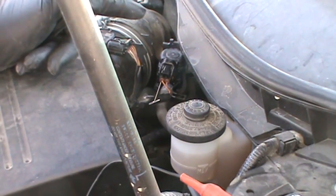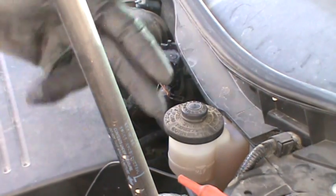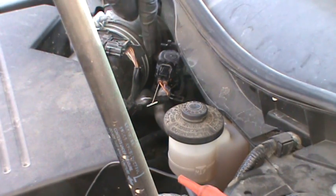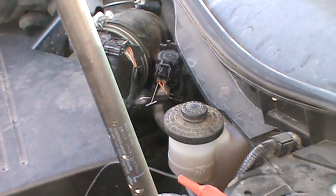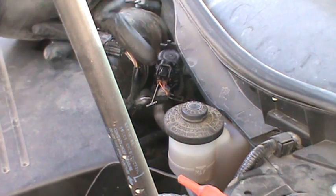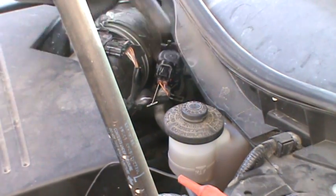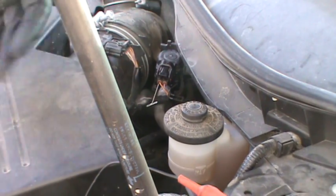The point is, when you got a wire going to it right there, it's going to produce a lot more amperage because electricity is coming in here, running through the electrical connection which is basically a coil of wire that produces a magnetic effect when there's power on one side and a ground applied on the other side, and it's going to open and close that plunger. So basically what I tested right now: the fuse is good, there is continuity through this coil because I'm getting power out on the other side — so I know it's not broken internally. It tells me the fuse itself is good and that it is actually activating.